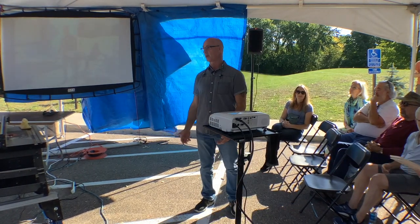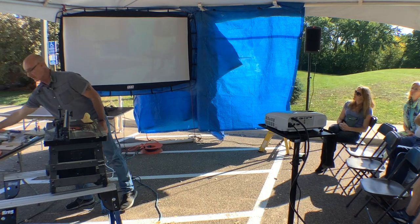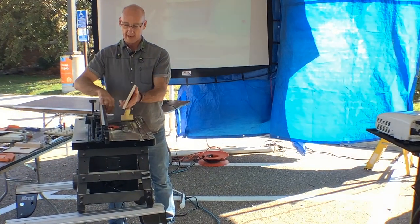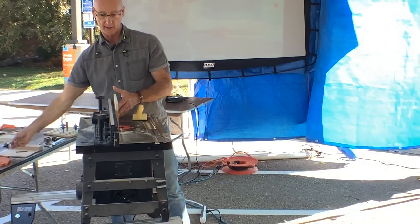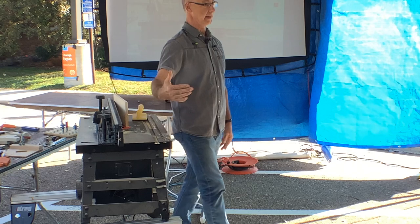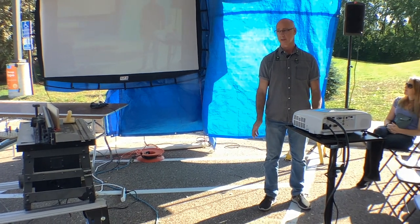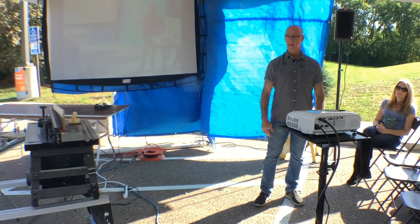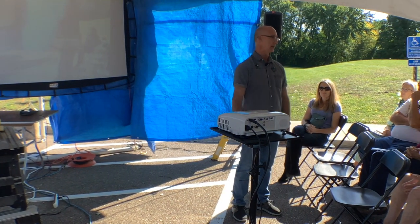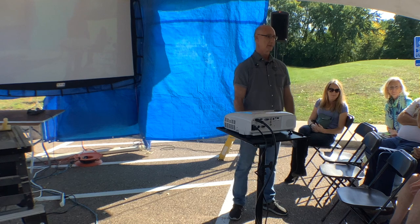Just because, I'm trying to get a table saw analogy, but the danger is, let's say I want to rabbet this piece. If I try to do that by feeding sort of like this, if this lifts off the fence just a little bit, I'm pulling it right across that cutter. I mean, never is a really long time, but in a few years of woodworking, I've never had an occasion where it's been imperative to set it up that way.